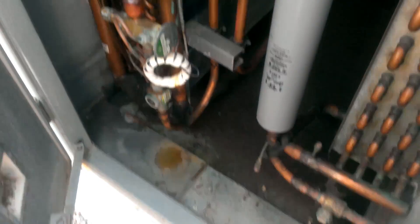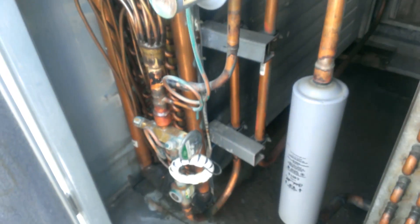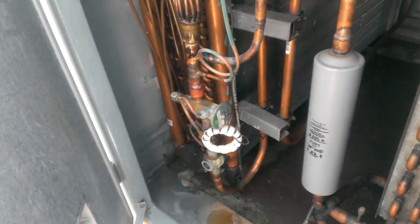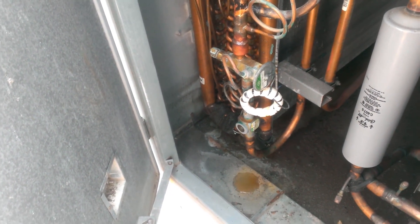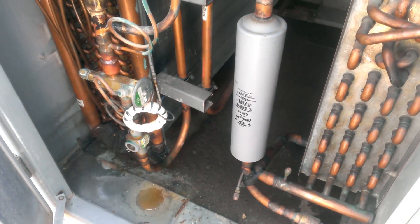These are pretty complicated. There's a damper there — it bypasses some of the air past the evaporator coils sometimes, depending on what mode of operation it's in. So it's based on room temperature, relative humidity in the room, and the temperature of the pool — those are the deciding factors, depending on priorities, for how it's going to run.